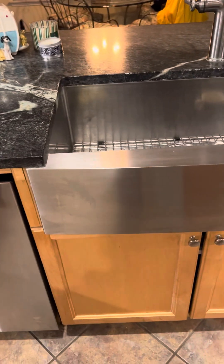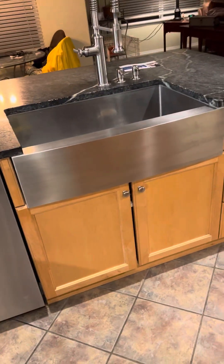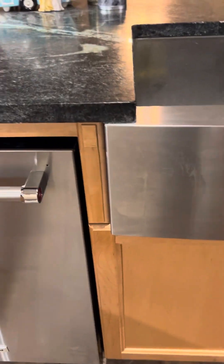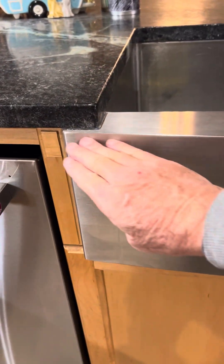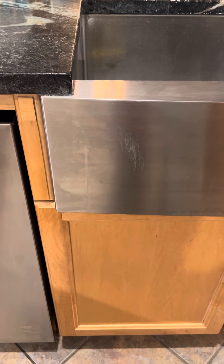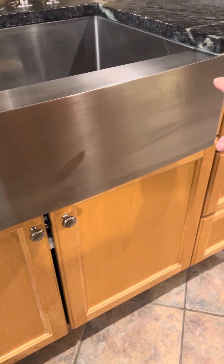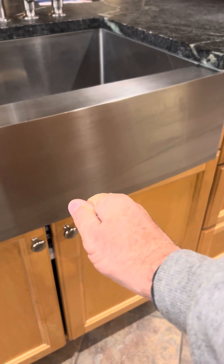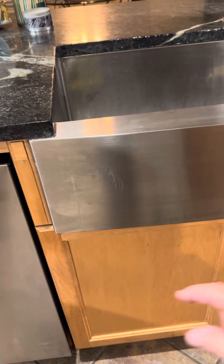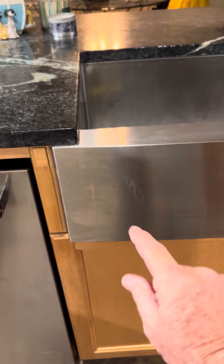And then we put this — I think it's called a farmer's sink. The nice thing about this is these counters are 30 millimeters, so this moves the sink down 30 millimeters. When we originally had the cabinets here, it had some kind of a splash door or something that you pulled down to store scrub brushes. All that was taken out, but then I had to fill this space, so I found some remnants, turned them sideways, and routed them so that they fit.